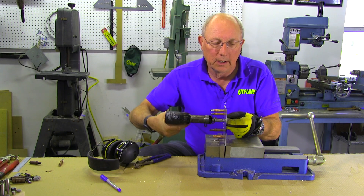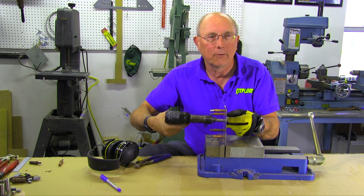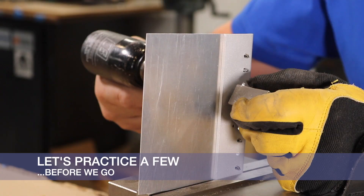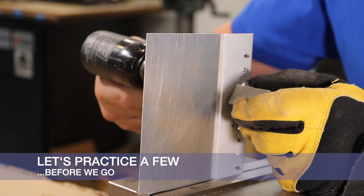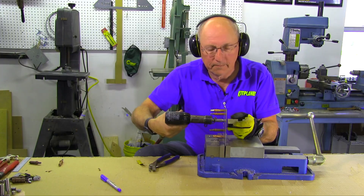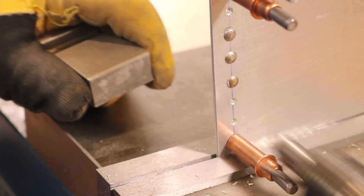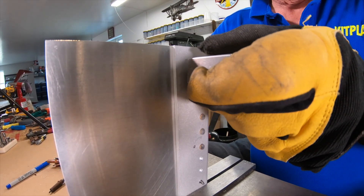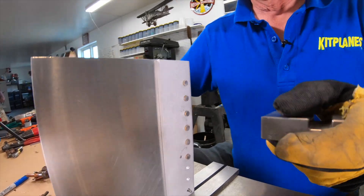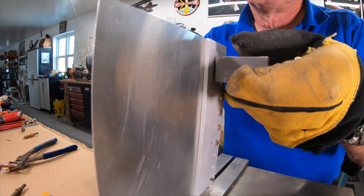If we could do this in slow motion, it would actually be bouncing on — you're pushing it in and that's hammering that rivet head into shape. You almost have to do some bucking to really understand how it works. It's one of those things that once you've done it, it makes sense. Driving rivets well is a matter of practice — keep doing it and you'll just get better. Thanks again to Aircraft Spruce for sponsoring the series, and thanks for watching.